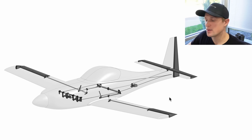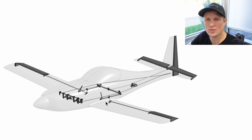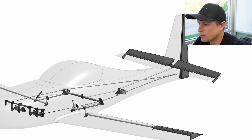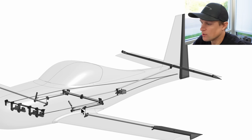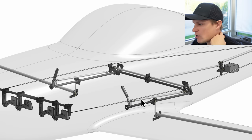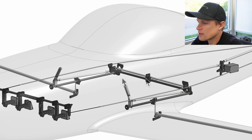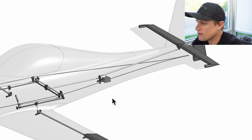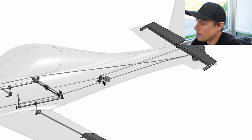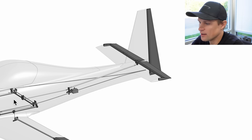I have the Onshape CAD model of the Dark Arrow 1 prototype here, with the airframe shown transparent so we can see the internal hardware that connects the control sticks to the control surfaces. We'll talk through the elevators first — you can see the control sticks moving forward and aft, and the elevator moving up and down for pitch control. Each stick has a push rod connected to it, tucked away in the armrests. The pilot and co-pilot controls are ganged together through a torque tube just behind the seatback, running laterally. Running aft from there is a mid push rod connected to a bell crank next to the pitch autopilot servo, and then an aft elevator push rod directly connected to the elevator. You can see all those move together to give us pitch control.